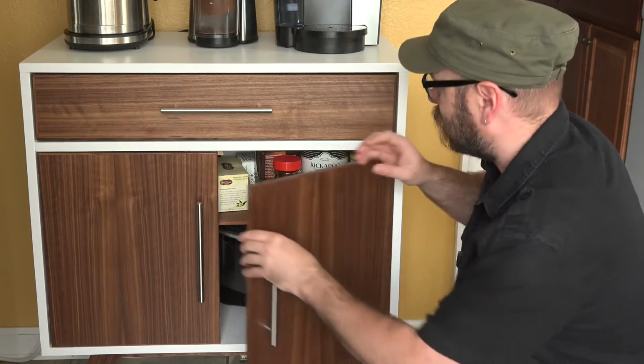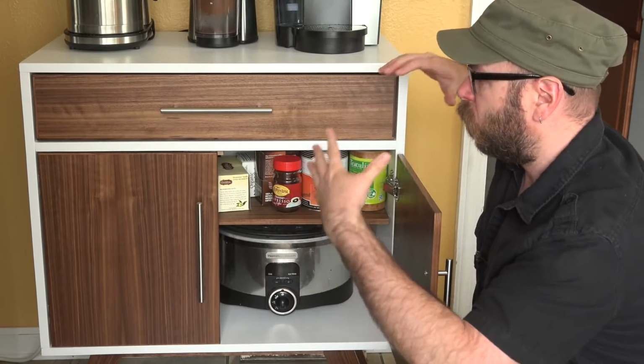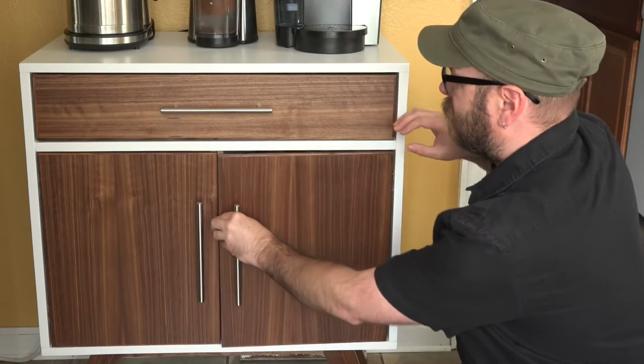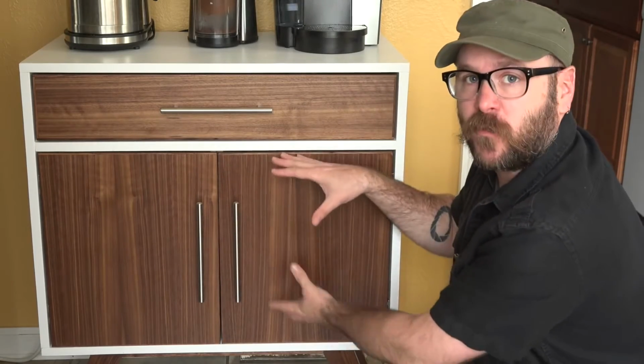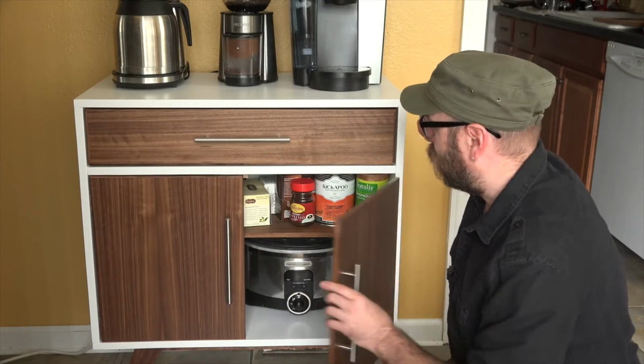And these doors are a 1/2 inch, so obviously that would not work. But these hinges actually worked out great. I'm very happy with them. There is no adjustment with them. So when you put them on there, you are stuck with that. You can't put them on there and then adjust for different gaps. So with a 3/4 inch thick door, you have a lot more options.